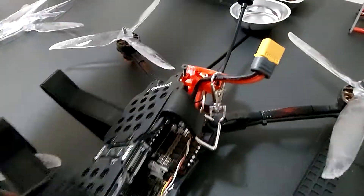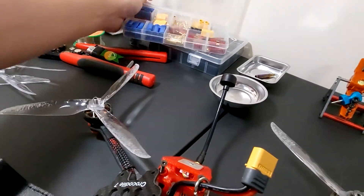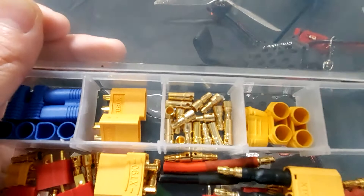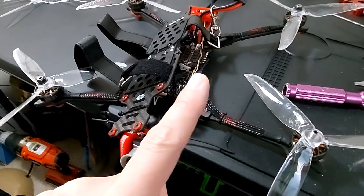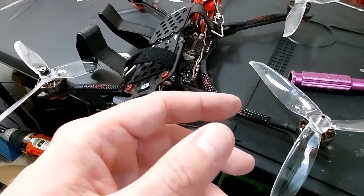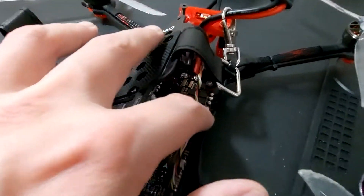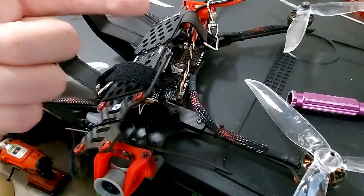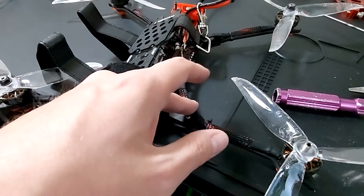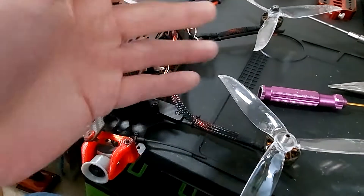So what I'm going to do — I have a lot of extra 3mm or 3.5mm bullet connectors. I think I'm going to equip all of these with bullet connectors. The reason: number one, I don't care about weight, it's not going to add that much, and I'm not racing this quad. But the bigger advantage is, once I solder them on here, if I get a motor wire backwards I'm going to have to desolder and re-solder. If I can just put bullets on here, and if I mess up a motor, I can just swap it out easy without having to solder.